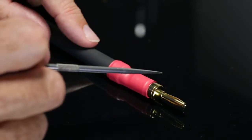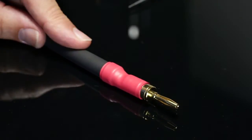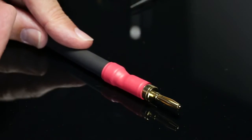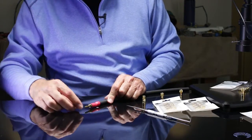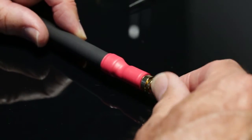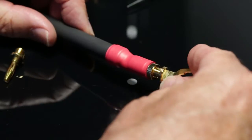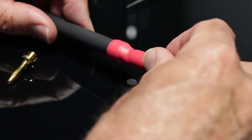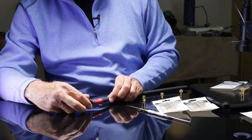Let's use this as an example. Let's assume the cable came with a banana connector and you bought a new amplifier and would like to put a combo spade on the end for the amp. All you have to do is simply unscrew the banana connector and replace it with the terminal of your choice, screw it on, and then give it a little twist to seat it — now it's locked in and will not move easily.